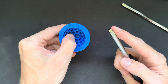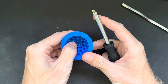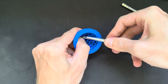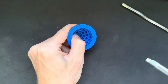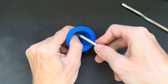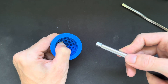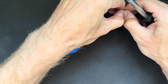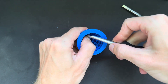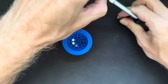The second magnet — push it in. Sometimes they pop back out, so the assembly can be a bit tricky. What I do is cover the magnet that's already inside with my thumb. Push it in, and then don't pull the screwdriver straight back out, or the new magnet will stick to it. Push it in again, then use your fingernail to hold it and pull the screwdriver away sideways — then it will stay inside. I'll speed up the video to finish the first circle.